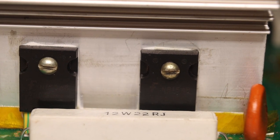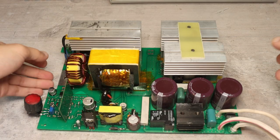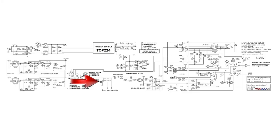In the presence of control pulses at the output of the optodrivers, all power switches are open — there are four of them, and each pair is connected in parallel. When triggered, the transistor switches power to the primary winding of the transformer; as a result, voltage is induced on the secondary windings of the same transformer and the inverter starts. In the absence of a pulse, the switching transistors are closed. The residual energy of the transformer is extinguished through the so-called demagnetizing diodes, which are installed in the opposite direction. This energy actually returns to the system, recharging the input capacitors. With a forward stroke, the current from the transformer goes through direct diodes to the welding electrode. When there are no control pulses and the transistors are closed, the current is maintained by the energy stored in the inductor. This current through the reverse or shorting diodes is supplied to the load.